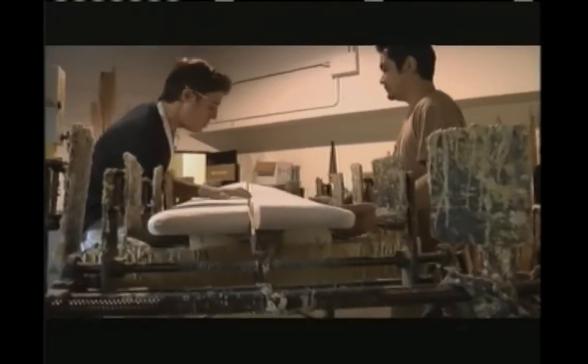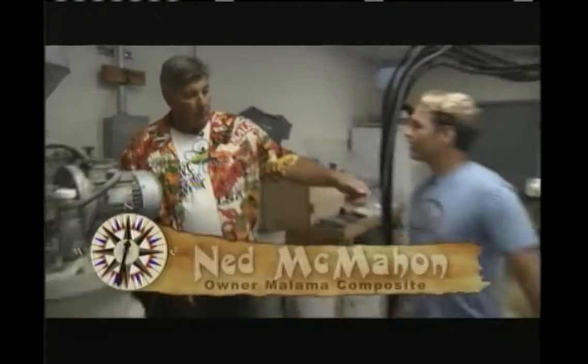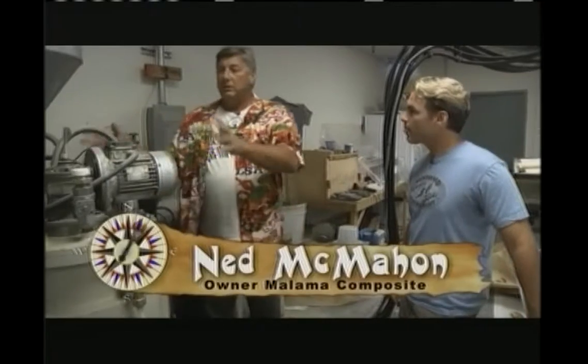All right, so now how do most companies make surfboards? Well, it starts again with the blank, the core material, and most blank companies actually pour the chemicals into a bucket and stick the bucket under a milkshake mixer, a big giant one, and then pour it by hand into the mold. What we do is we use a machine so that it's all computer controlled. It's a lot more precise. We get an even flow of foam. The foam is very consistent through the thickness of foam. It makes a much better quality foam.